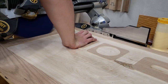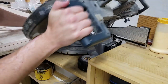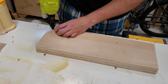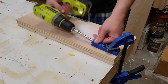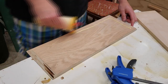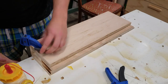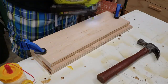This table is assembled with 45-degree bevels on all four sides — fronts, backs, and side pieces — to create a totally seamless product without edge banding or butt joints. I began assembly by gluing up a thick piece in the middle to act as the drawer divider and a structural rib for rigidity, then drilled pocket holes in it for mounting. The two side pieces also received a thickener plate with pocket holes, which made assembly easier and added thickness so the drawer slides wouldn't hit against the face frame.